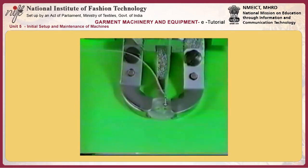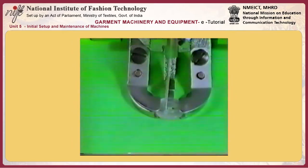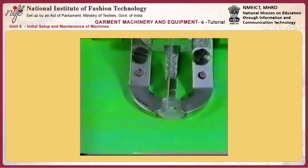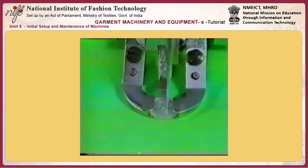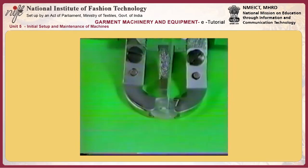When sewing 2-hole buttons, the needle throws to the right at the start of sewing. The 7th and 8th stitches are tie stitches at the end of sewing. When the number of stitches to sew 2-hole buttons is set to 16, the 7th and 8th stitches and 15th and 16th stitches are tie stitches, which means tie stitching is performed twice.